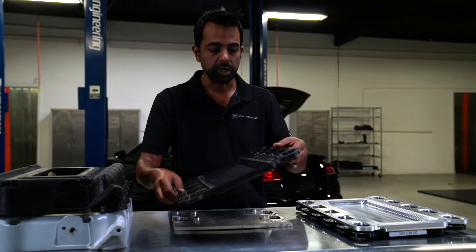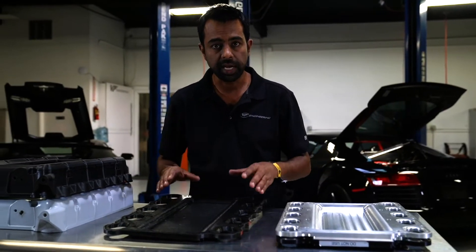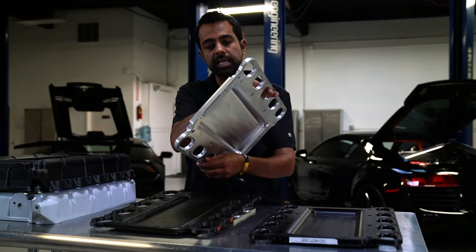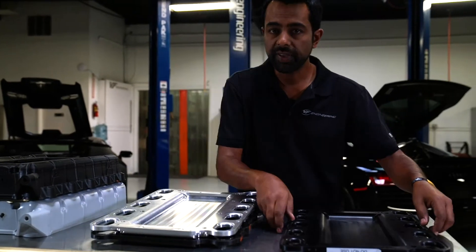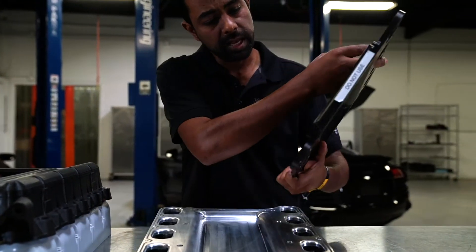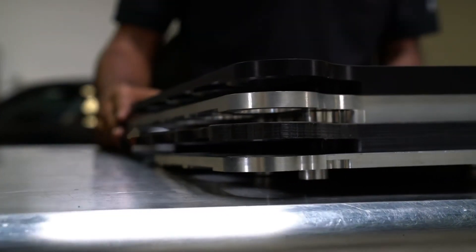We designed that in SOLIDWORKS, computer-aided design software, and created a complete piece and then 3D printed it. The latest technology in manufacturing and prototyping allowed us to test fit the actual concept and design. Once that was committed, we were able to create a pre-production piece in aluminum — 6061, a pretty rough cut piece — and then a finished production piece with a type 3 hard anodized finish, with additional features, strength, and pocketing to lighten it up.